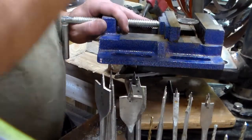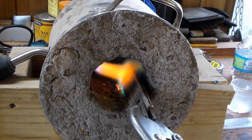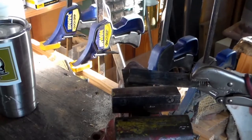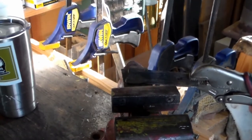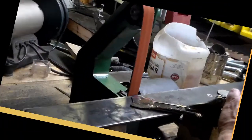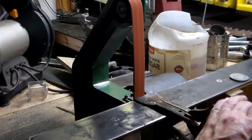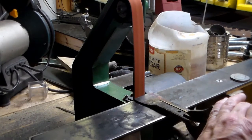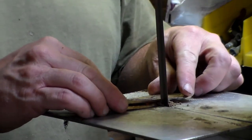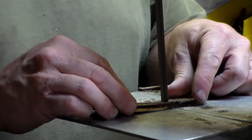I put this piece in here even though I didn't end up using it — I went with a piece of brass instead. I just threw it in there because that was my original plan. This is a brass threshold for a doorway. I'm heating it up and I'll beat it here in just a second to get it flattened down. After I got it flattened out enough to work with, I went ahead and shaped it up — it's basically going to be a finger guard. I went with a more rounded shape rather than flat at the top, shaped it up, and sanded it.